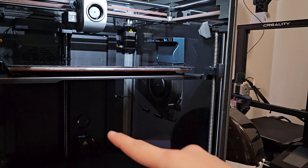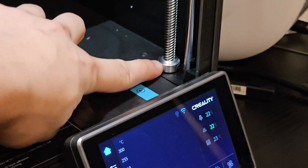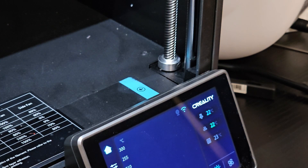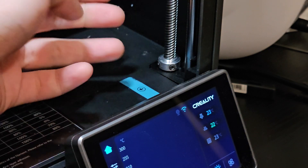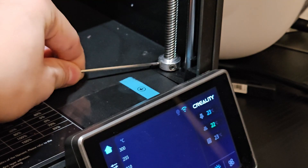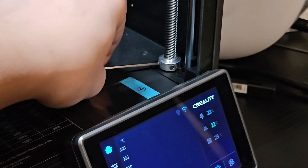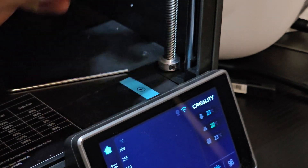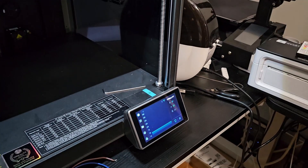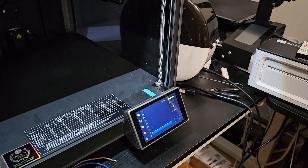I lowered my bed a little bit to have some room to work with. If you look at the two front lead screws, you can see the bottom part. Keep lowering it until you see the two tiny screws in a position where you can access them. Then take your Allen wrench that comes with the printer — I believe it's the second smallest one. Put your Allen wrench into the screw and you can actually move your lead screw pretty easily. If you try to hand-move it, you can't — that's why people say you need to tilt the printer, take off the bottom panel, un-tension the belt.